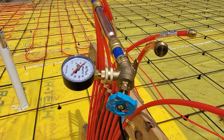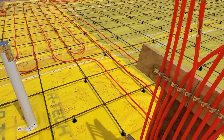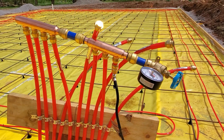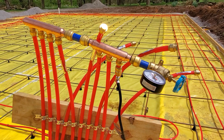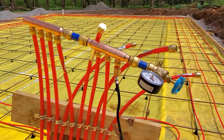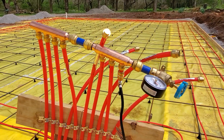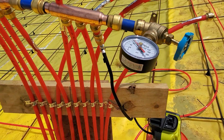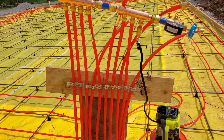On SharkBites — when I was doing this, people say you get your SharkBites and they're made for water. Well, SharkBites seal up to 200 PSI and it doesn't seem to matter what you have in them. I've got 60 pounds in there and it's holding strong. I'll check back later and make sure everything's okay.